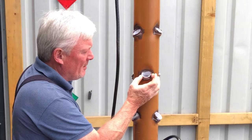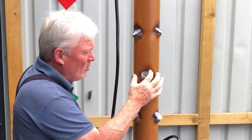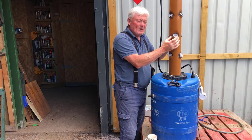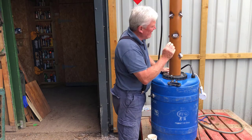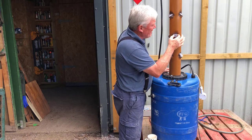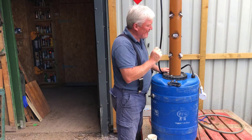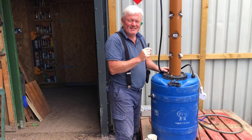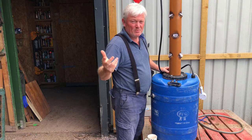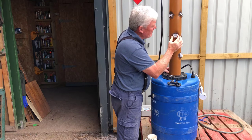Initially I wasn't planning on gluing any of the pipe pieces in, but water was still dribbling out due to the shape of the holes. So I decided it was prudent to silicone them in with food-grade silicon sealant — this pipe is okay for food and the sealant is food safe. That way there's no water dribbling down whether you've got a plant in there or not.